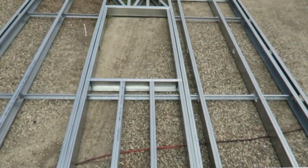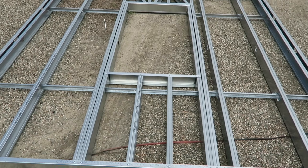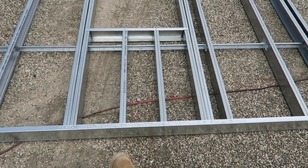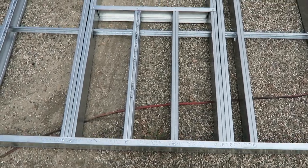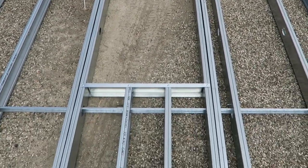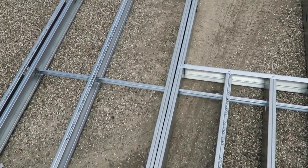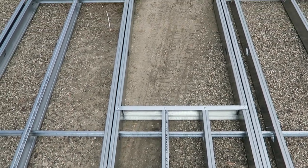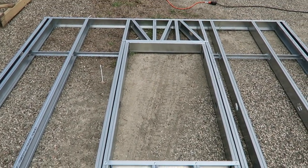And this is the wall, guys, all done. We have the footer down here. I don't know if that's really what it's called, but that's what we've been calling it. And then the header up there above our little opening for the reading nook, and those things going across are the U-channel. Some people do this with track going across like that, but we chose to do it with the U-channel because we thought that'd be a little bit stronger.